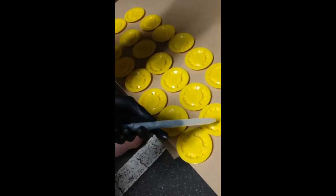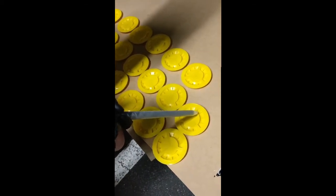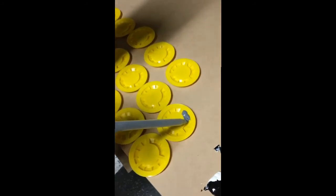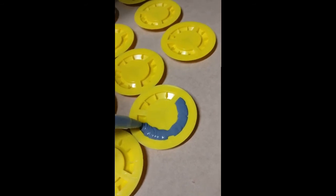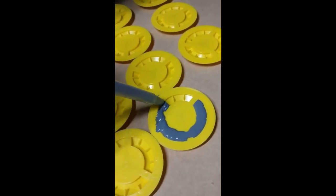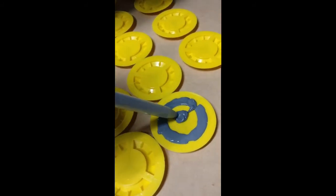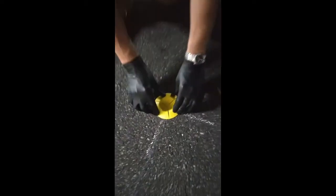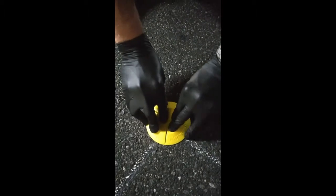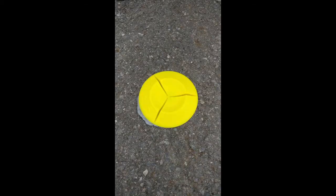Fill all the fins around the Trolley Stopper with the epoxy. Also put a small walnut-sized dob of epoxy in the middle of the Trolley Stopper. It is important to note that the epoxy should be a grey colour — if it is too dark or black, then you may have an issue with the mix and it may not stick properly. Now you are ready to stick the Trolley Stoppers down. Just remember you have 5 minutes working time before the epoxy starts to go. To fix Trolley Stopper in place, simply locate the centre of your lines and place some small pressure on the Trolley Stopper onto the surface.